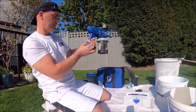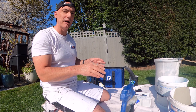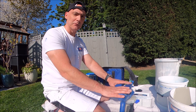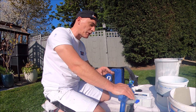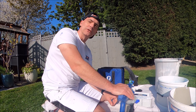Battery on. Now let me just talk about this filter for a second. The one I've just put in is slightly finer than the black one that was in there originally, but we're going to get away with that. With airless sprayers you don't normally need to thin emulsions — unlike HVLP or XLVP — and fairly thick emulsions can be sprayed straight through without thinning. With this fence paint it's quite a thin consistency anyway, so we'll get away with the finer blue filter. But if you're spraying emulsions or anything like that, please stick with the black one.